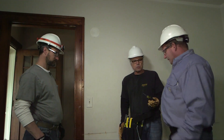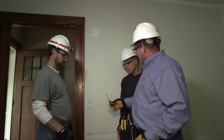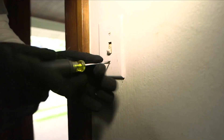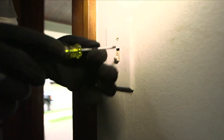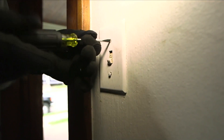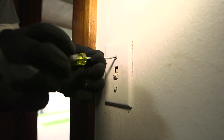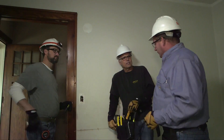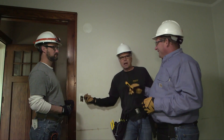The first thing we're going to do is take off the switch plate, and we're going to use this trim screwdriver — it's the proper size for the trim screws. How many of us have just said, 'I'll stick my jackknife in there and start her out'? Use the right tool. These tools are design-specific. Use the right tool and things will be safe — things will come off without any damage. Safe is the operative word, because we don't know if there's juice behind here.